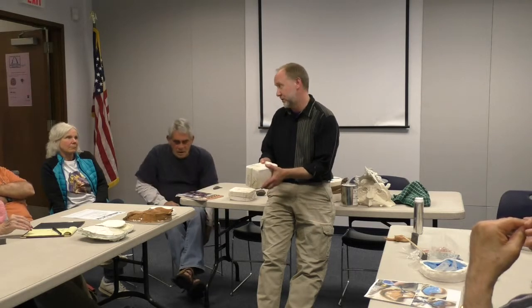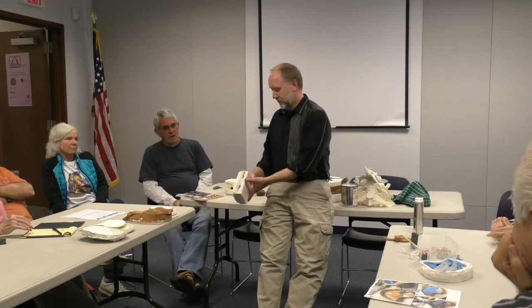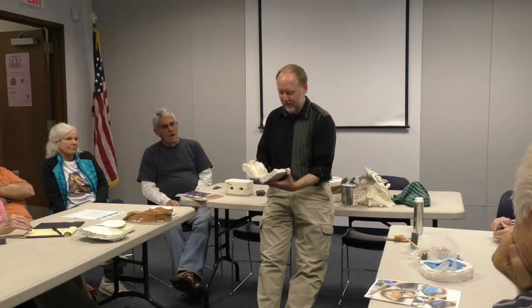Let's see. Oh, my little turtle. We're gonna come back to my little turtle in a little bit. If I set him down on the table here, underneath his head is a big undercut. I can just go stick my whole finger right under there. That's a problem. Because if I have my clay and I surround it with hard plaster, now I can't get that clay out. Now the clay I could probably get out if I keep working at it, out from under where those undercuts have grabbed hold. However, if I get it out of there and now I pour in plaster, I'm never gonna get that out.